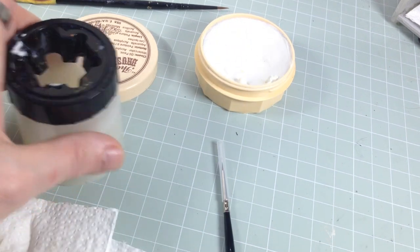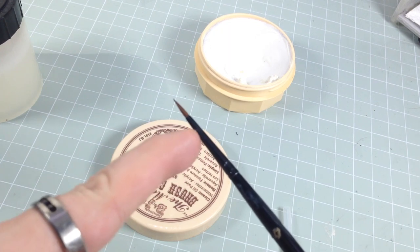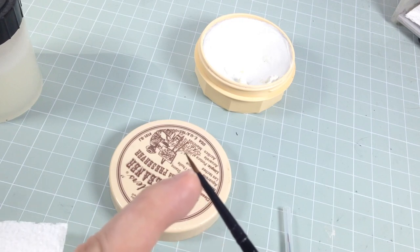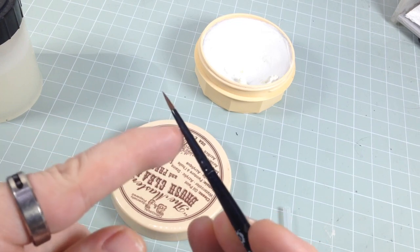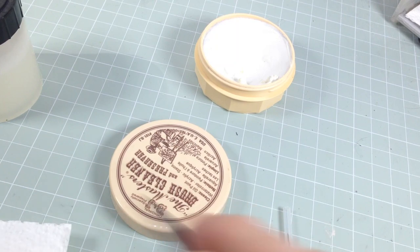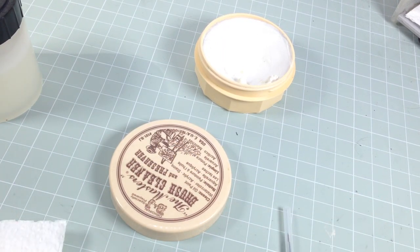One more trick to extend the life of your brush: when you're picking up paint, try to only get paint about two-thirds of the way up the bristles. Don't dip it so far that paint comes up to or over the ferrule — you're just pushing paint into the ferrule. If you keep paint to two-thirds up the bristles, there's no paint in the ferrule for it to try and dislodge, so your brush will last longer.